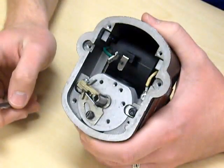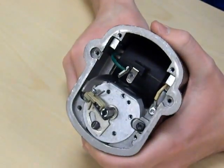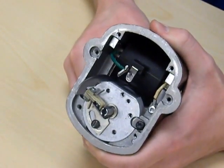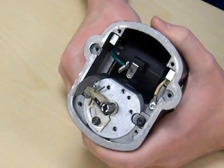The newer style magnetos have two slots, left and right. This is a left-turning magneto, so we insert it into the left slot. Then we rotate the rotor counterclockwise until the tool will rest on the left core lamination. This means that the magneto is now at E-gap.